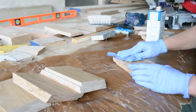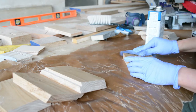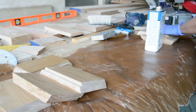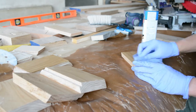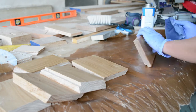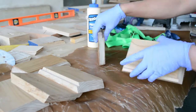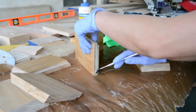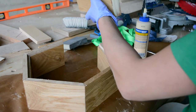I'm almost ready to assemble my first shelf, but before I do I want to test out an idea — I want to pre-finish the exposed faces with a layer of teak oil. My hope is that after I glue up the assembly, any glue that squeezes out won't soak into the wood but rather sit on top of the oil so I can easily wipe it off. I've had trouble in the past where squeezed-out glue stays in the wood no matter how hard I try to get it out, and ends up repelling the stain or finish I try to put on later.